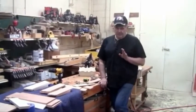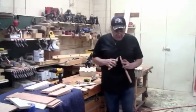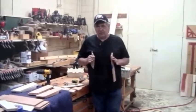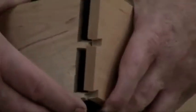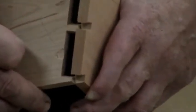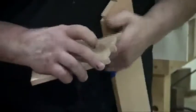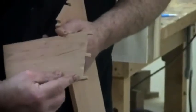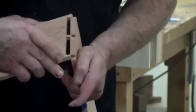You're going to have to stay with me on this. One of the things when you're dovetailing something on an angle is you have a lift that's based on the angle. If I line the bottom of this dovetail pin board up, you can see how much it's off from not going in. That's because each one of these pins has an angle to it — so as it goes in, it lifts into place. We have to deal with that.